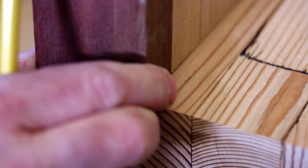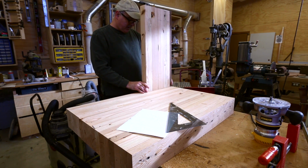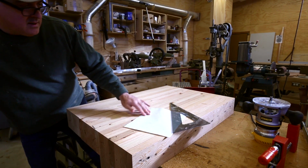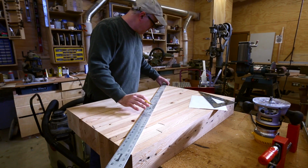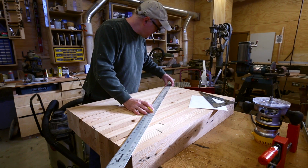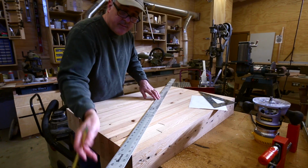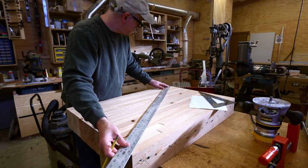So I can figure out where the nose of the bottom tread is by just putting that tread where I want to put it. And I can mark that. And now I can draw that same line that I had on the piece of paper from this corner down to that mark at the nose of the bottom tread. I can draw a light line, and then it's just a matter of dividing that line into thirds, and it's 42 inches, which makes it really easy.